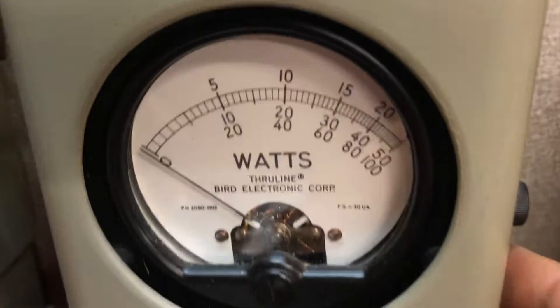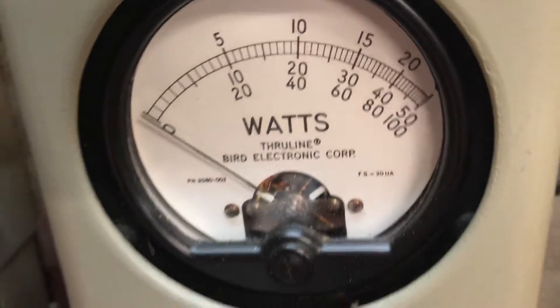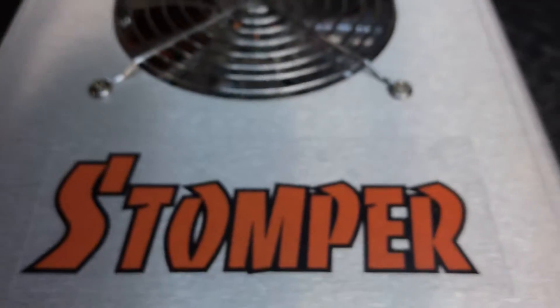Now the swing isn't what gets you in trouble — it's the dead key, SWR, and heat. You can swing up to 200 watts in an 8-pill, no problem. But you've got to keep the carrier down. If you don't keep the carrier down, it'll eat transistors.